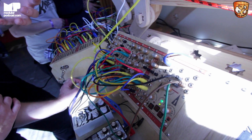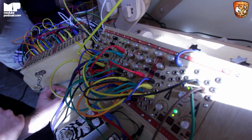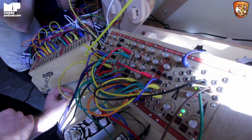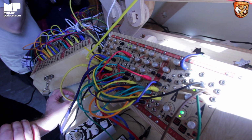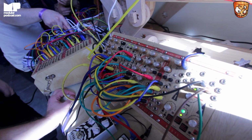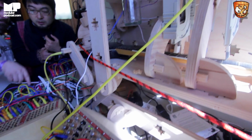And again, another trick, I don't often see people mention it, but it's one I really like: find a rate of audio rate modulation that works for the input, and then split the volt per octave to my input and to the sample rate. It's nice to see it really easily implemented. Yeah, it's a combination of three utility modules, but it can do so much.